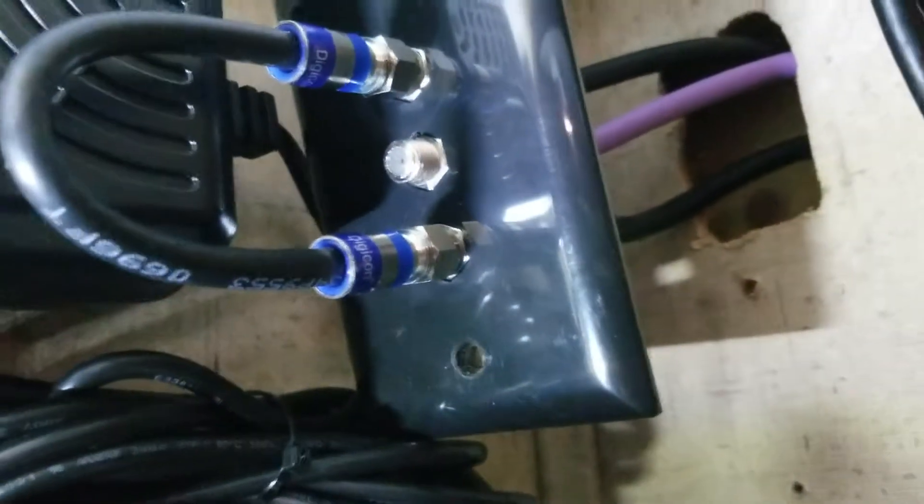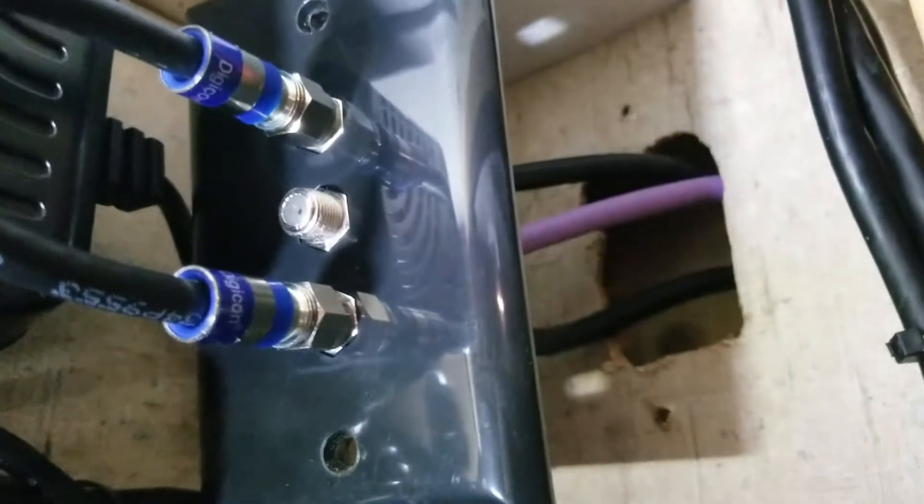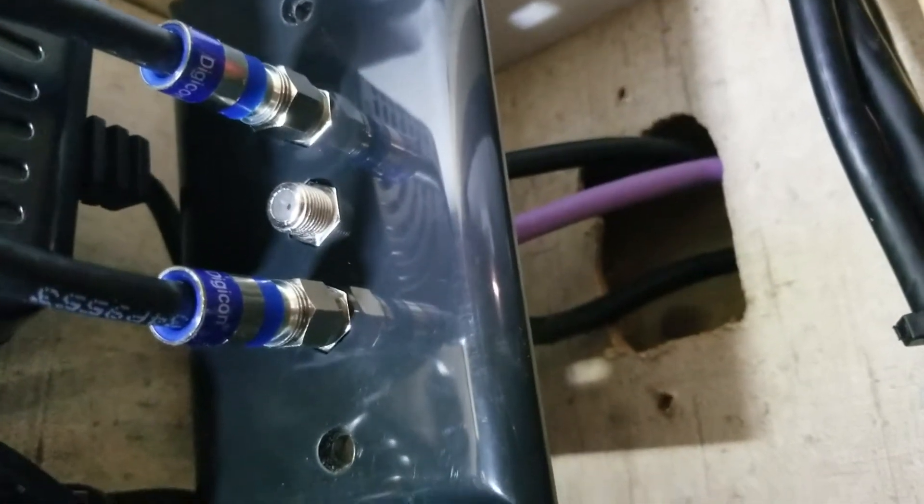The center one here I've come to the conclusion is this purple cable, and it actually goes up to a rooftop jack for satellite purposes. So you might want to look around if you're looking to connect satellite, to see if you've got a rooftop plug. Mine was capped over, and that has the other end of that purple cable going to it.